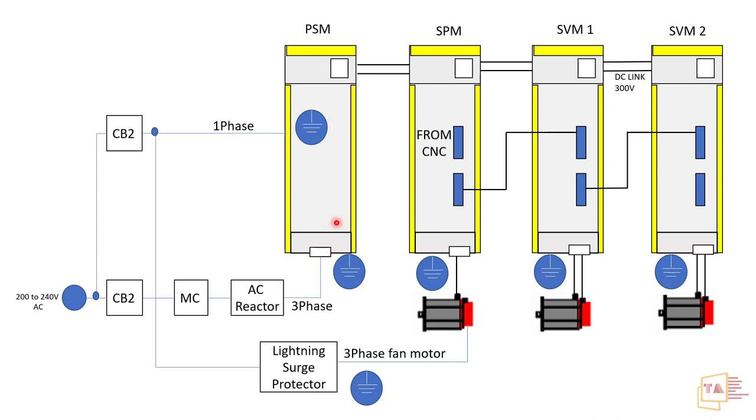Because we cannot directly control AC supply, the PSM converts the three-phase AC into a constant 300V DC. This DC is then controlled and converted back into AC to feed AC servo motors. The PSM distributes this 300V DC via a DC link — two bus bars, positive and minus — to all the drives. By controlling the DC we can ensure proper positioning, speed control, and everything needed in the CNC machine. So the PSM converts input power into control voltage and DC link voltage for the drives.